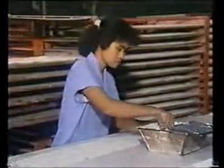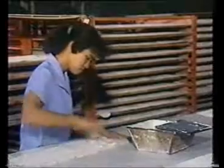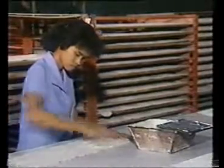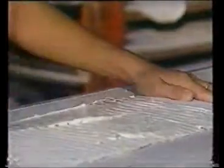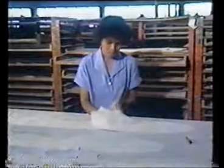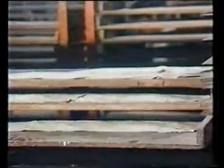A cement compound is applied to specific margins along the edges of the components. Great care is taken at this stage to ensure no dried cement particles are left on the components. The components are then left to dry on trolleys for 4 hours before being combined with other components to form the boot. Some components require 2 or even 3 coats of cement.